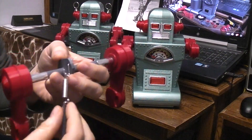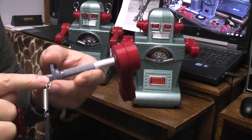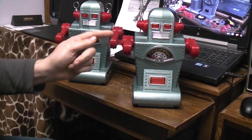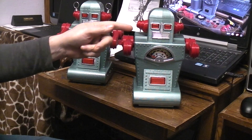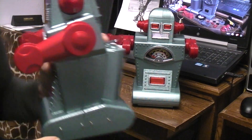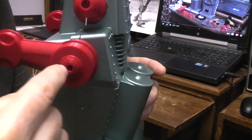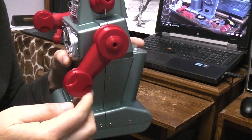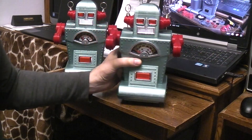Even though it works, that means if I made more of them I'd have to try to come up with the same springs, and the coupler between the spring and the arm would have to be the right length. So I decided to go back to the standard way of doing this sort of thing, which is just a mechanical link — it's solid between the cam that's doing the pulling on the arm. Then on the arm itself, this one is solid because it's glued right onto the arm axle. On the other one there's a recess, and in there there's a screw which screws the arm into the arm axle. Depending on how tight you make that screw, you can position the arm, and it won't pull on the linkage inside. So you could have your arms in any position you wanted. I'm going with that because it's simpler.